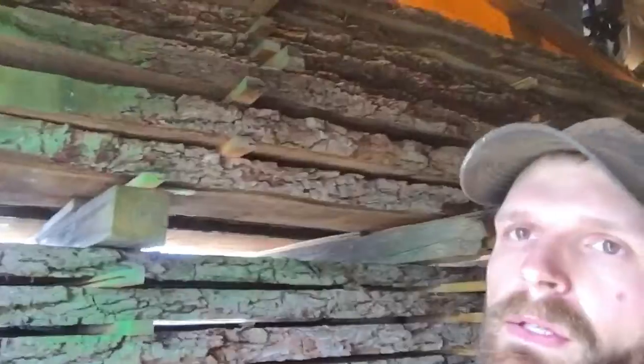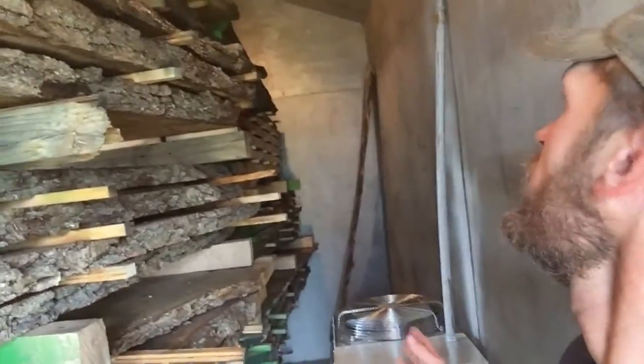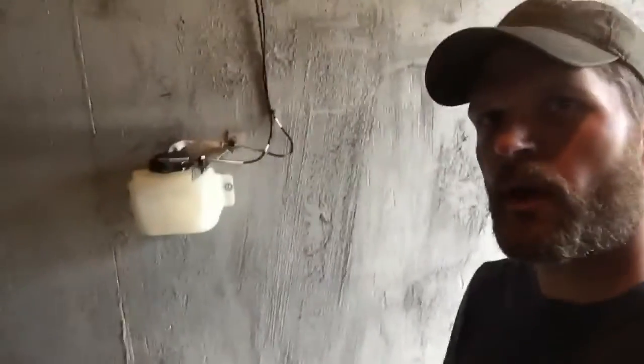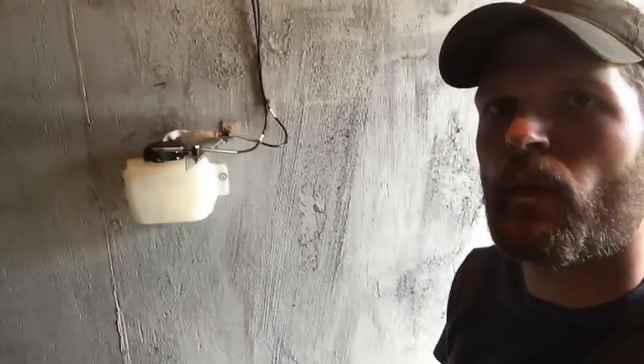You can see here, once again, we got the fan wall up top, and then the burlap tarp coming down, and this will be the vacuum side. Those fans are blowing, so this is going to be under suction. The air's coming through here, coming this direction toward the dehumidifier. We have the wet and dry bulb thermometers right here, and those are what the monitor uses to determine whether the dehumidifier is running or not, as well as the auxiliary heater.